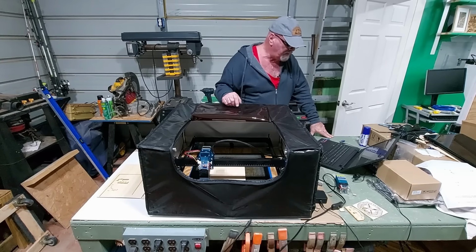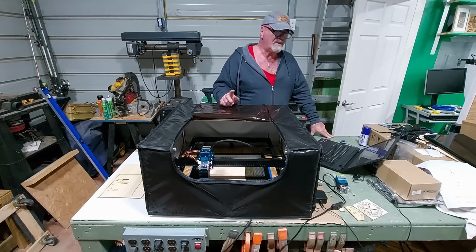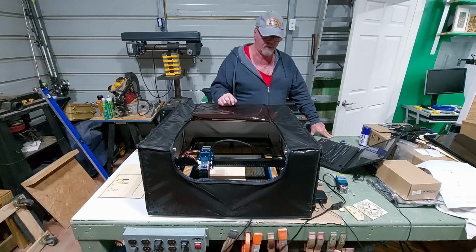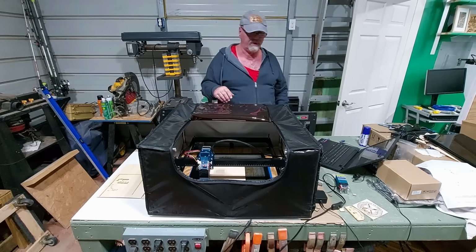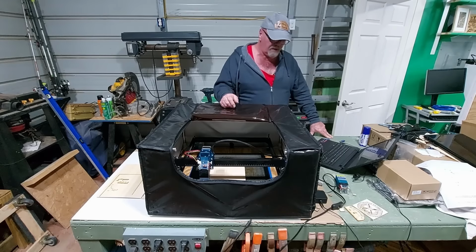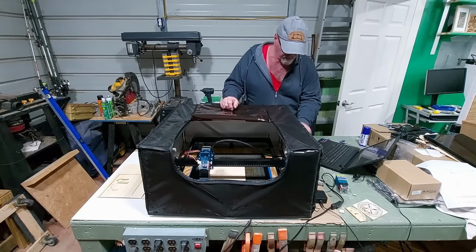I've got the power set at 50. I've got the speed at 2000. That's the same. Now, do I double the speed? I don't think so. I think I just cut the power in half. And on the cut, I've got the speed at 120 and 50. And I know that my NAJ will cut through at 250, so I'm sure that this one will. And everything else is the same. And that's the only 2 parameters that I've changed. So what I'm going to do is start up this air scrubber real quick, get it in the right spot.